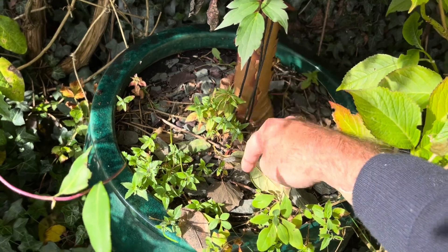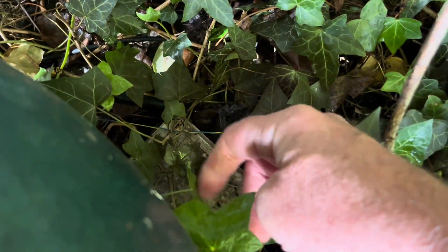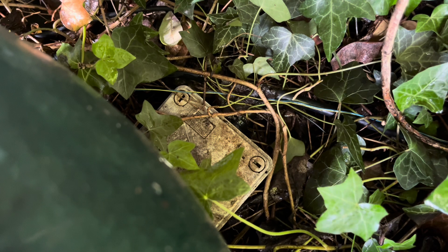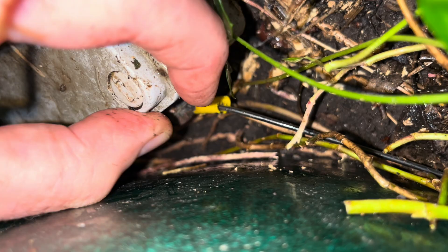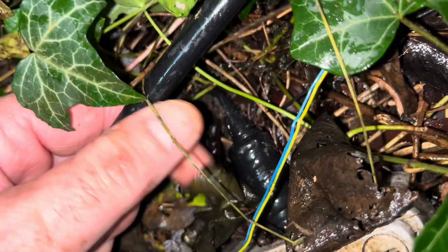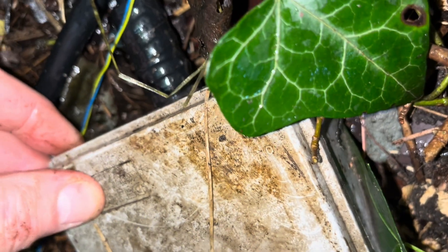I can't move this pot — it's rooted right through into the ground. I can feel it — in fact you might be able to see it down there. There's the connection box, but it's quite tight because one wire goes that way and one wire goes this way. I'm going to try and free it up somehow and see how it's looking, try to see the connections without disturbing it. The wires are still connected and that's still rubber sealed. That's a top band radial, that's coax going down to the five-eighths — so this is the feed. The coax to the loop on the ground still looks okay.